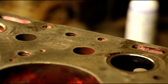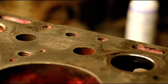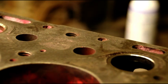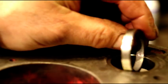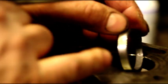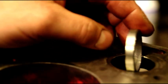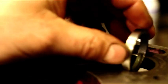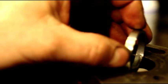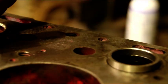There is our seat installed. Now let me grab another seat and show you — there is a right and a wrong way to put these in. This edge right here is rounded and this edge is very sharp and square. The rounded portion of the seat goes down and the square edge is up — there is a top and a bottom to these. That rounded edge goes down. You'll see it clearly when you get your new seat in your hands, but just make sure you put that rounded edge down. That's how they're supposed to be installed.